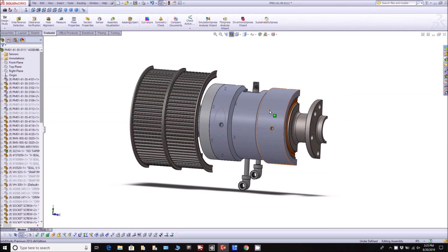Here's the cutaway of the redrive in CAD. The reason I never went with a full oil bath or full oil feed system until now was because the engine would have to feed it, and the engine puts out just enough oil at 60 psi to feed itself. If the redrive was receiving that same oil feed it would compromise the engine's oil supply. But Mark pointed out that when the governor is running it's providing high-pressure oil to the new oil collar, giving a kind of constant feed to the redrive, and when it's not running the engine is idling and you don't need a full feed to those bearings.